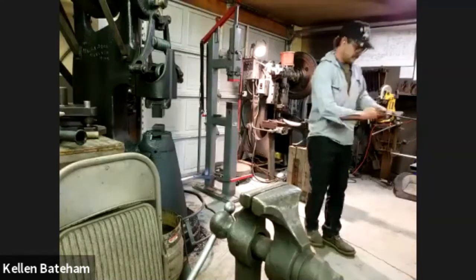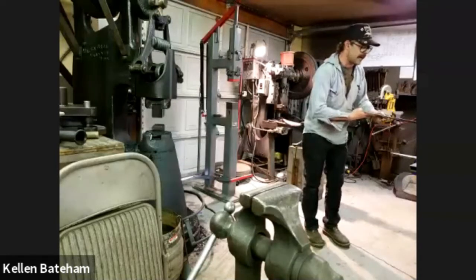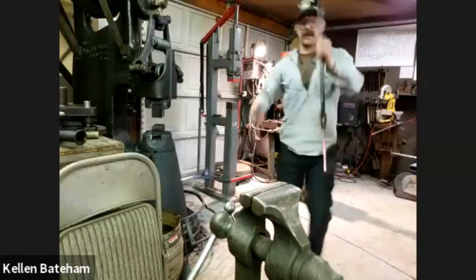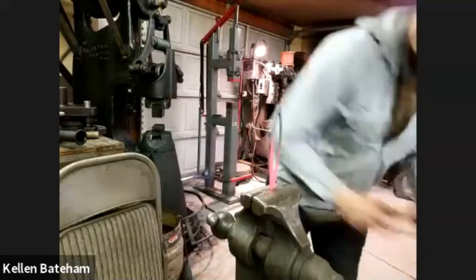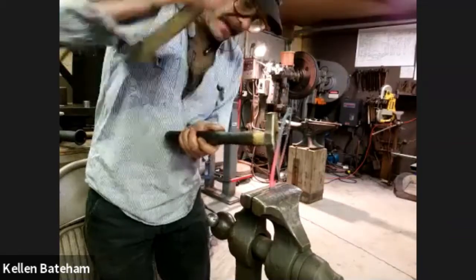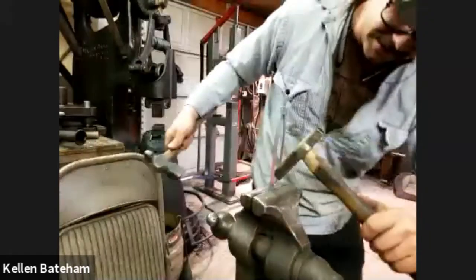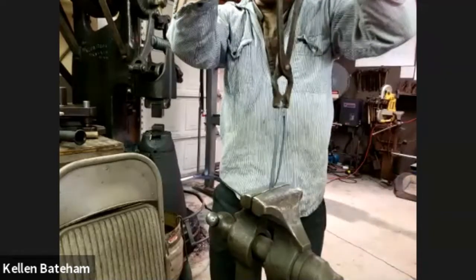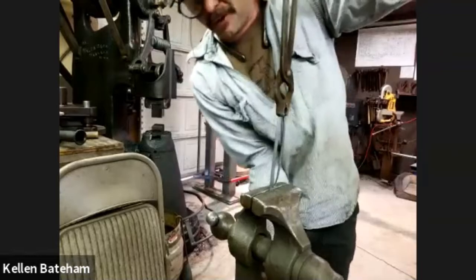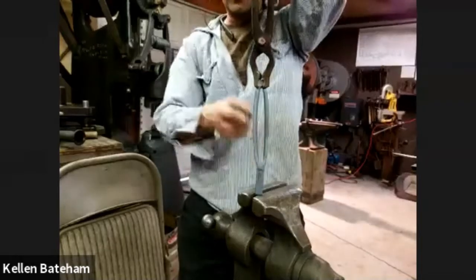Someone has asked, does the treadle have a place to insert and hold tooling? Yes, both the top and bottom have 1-inch square holders that he's broached in like a key pin on the side so you can lock them in. Unfortunately, my anvil Hardy is kind of an obscure size, like an inch and a 1/16 or about there. And so what fits in my hammer doesn't fit in the treadle. So I have tools for both, where in the perfect world I'd have the same tools for each. I just sunk that down there and dished out the bottom.